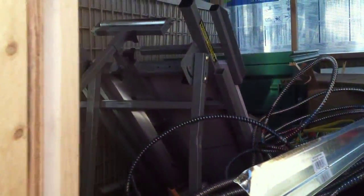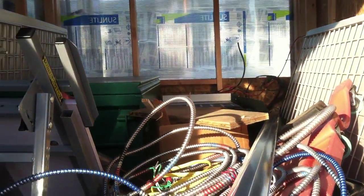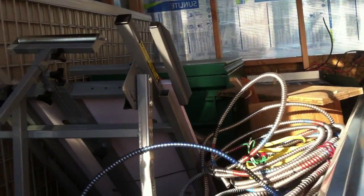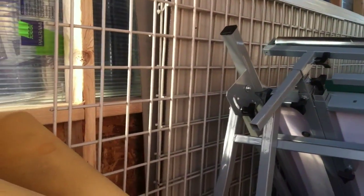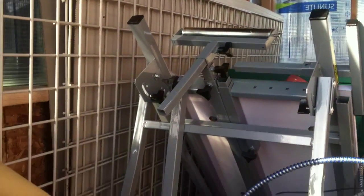This is the rear door section completed. The building is more or less complete structurally — it's good enough to haul. I'm using it to store some materials that are getting hauled up to the same location. The general idea on something like this: do not stack anything above the windows. I've got to keep the center of gravity relatively low — that window line is about where we want to be. I've got these metal things on the side so that a load-shifting situation spreads the stress out across the wall sections. With other plywood slapped onto the outside and all secured, we won't have a bowing issue on this wall.